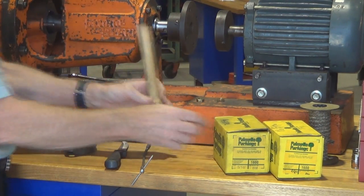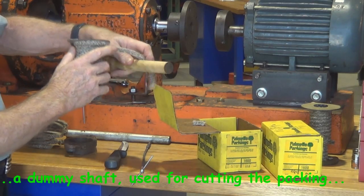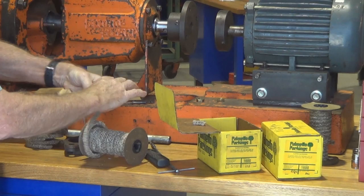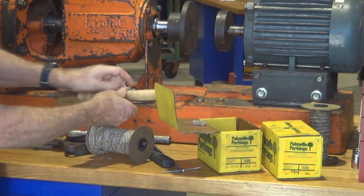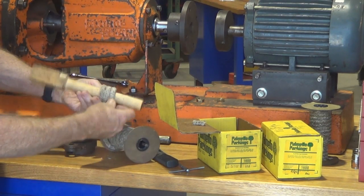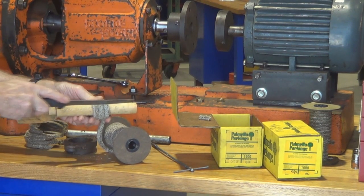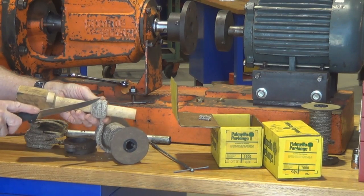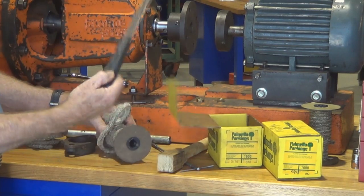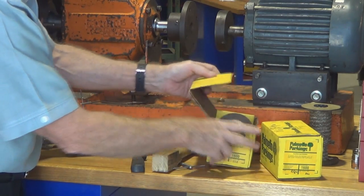This is a dummy shaft. I use this one when I am packing a valve gland. This isn't the right diameter for the pump we are working on, so I will just use rounds of packing brought out of the pump. But this is a good way of keeping the rounds of packing nice and straight, square, and consistent. For a pump we want a straight cut; for valves, 45 degrees.